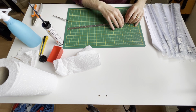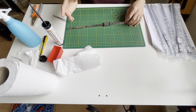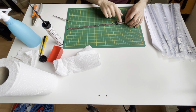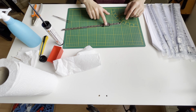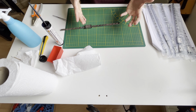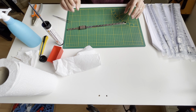I need to do this thing, I mean, remove the carriage, put the grease, put the carriage, go back and forth. I need to repeat this until the carriage is going on the rail smooth. Right now, to move the carriage, I need to push a bit. It's not like with the shipping oil, which is okay, don't worry about that. Just be careful about that.